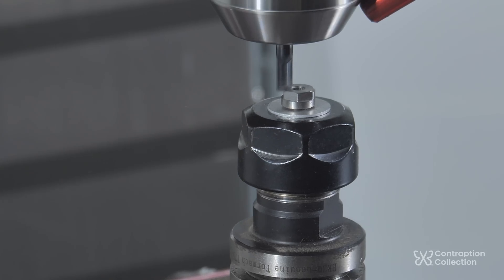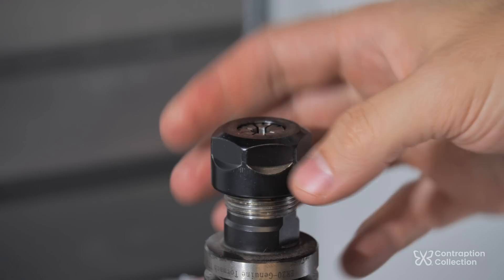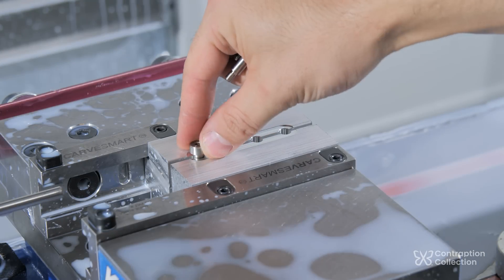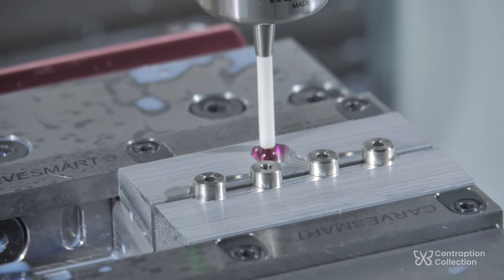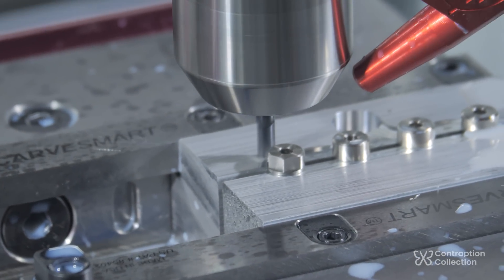Because I used a collet for this setup, which works in an up-and-down motion, I wasn't always cutting the same height on the screw. Let's use soft jaws instead — now I can do four at once. I like to put holes in fixtures like this so it's obvious where XYZ zero is. That's better.